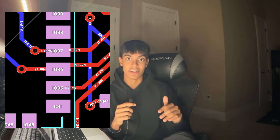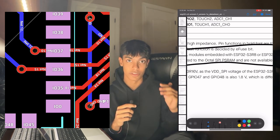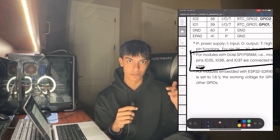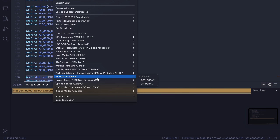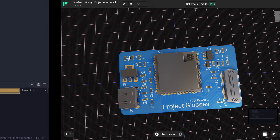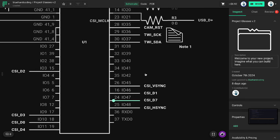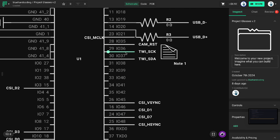If you look at this schematic, you might notice one big issue: I'm using the SPI pins that the ESP32 uses for the octal pseudo-static RAM, which doesn't allow me to take bigger frames or higher quality images. I was trying to enable the octal PSRAM on my dev module, but it wasn't working because in my schematic I was using IO pins 35, 36, and 37, which are used by the SPI according to the datasheet — which I should have read.